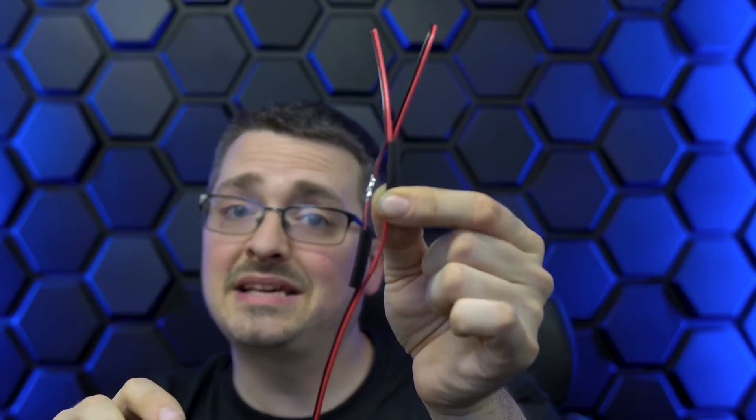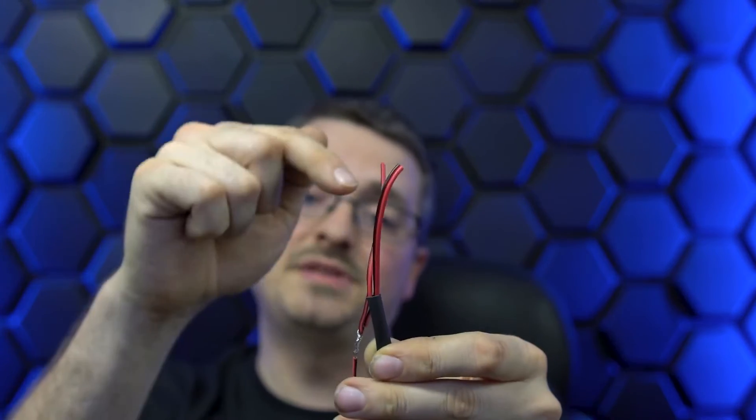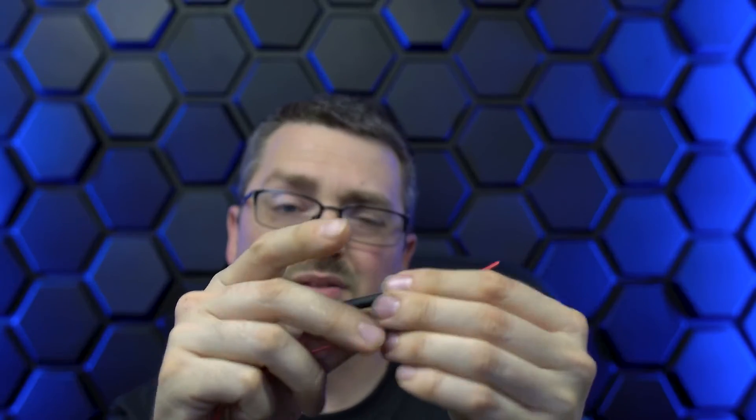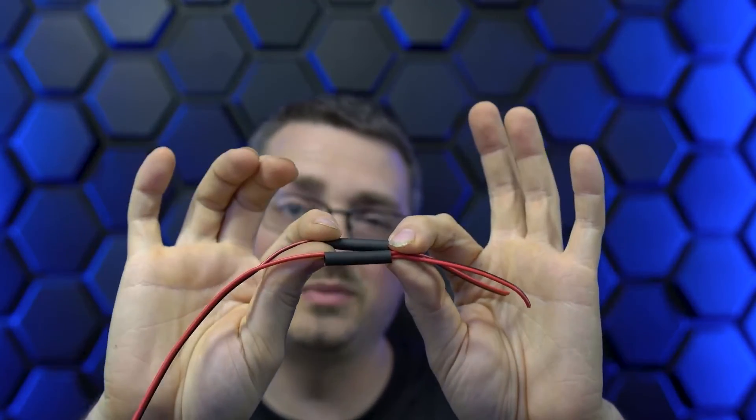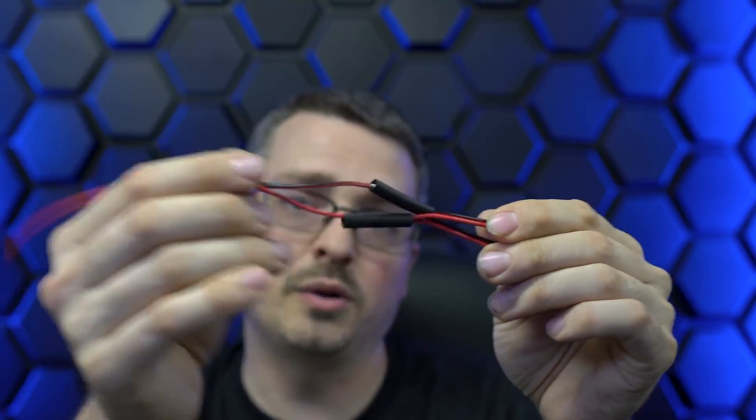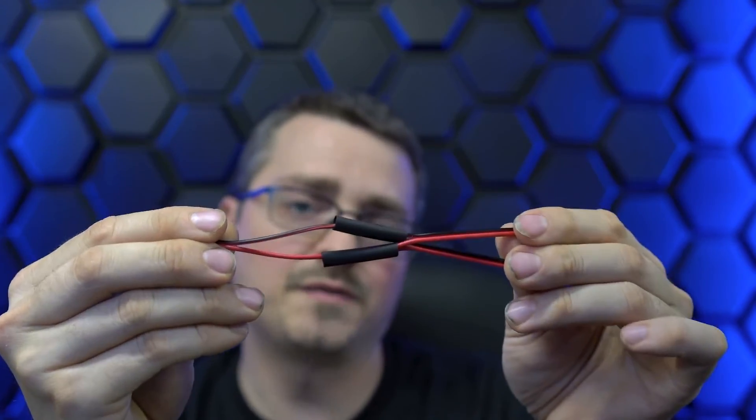That gives you an idea — that is the way I would split things off within the light using a splitter like this. It can be split as many times as you need. If you need to inject power 10 times, you can inject it 10 times using this method — you would just have 10 wires coming on this side and one here. You could even get fancy: have the main power wire coming in, five going out this way and four coming out this way, with one shrink tubing covering it all. This is a junction — that is all it is. Power comes in and it splits off to whatever you need. Hopefully you found this video helpful. If you did, please like and subscribe and make sure to check out nextlevelneo.com for all of your LED lighting needs.